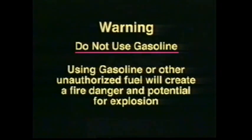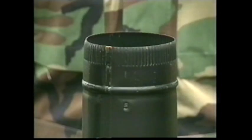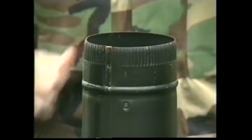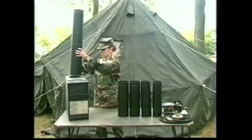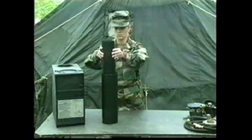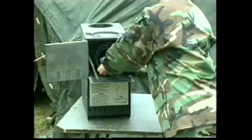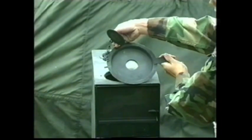The SHA also operates with solid fuels such as wood and coal. Each stack section is stamped with a number for easy identification and crimped on its smaller end to fit into the next higher section. The completed stack assembly seats in the stack adapter assembly, allowing combustion gases to discharge outside the tent. When disassembled, the sections nest inside each other for storage in the upper portion of the heater body.